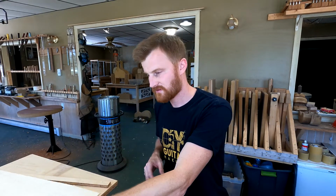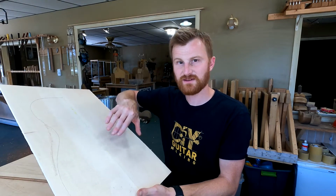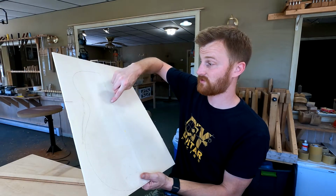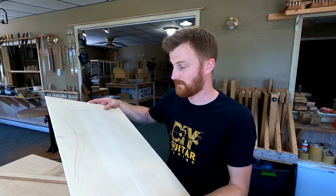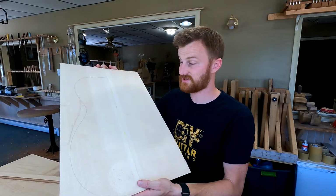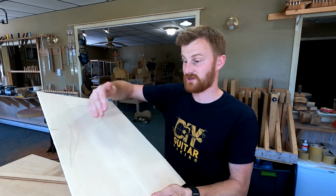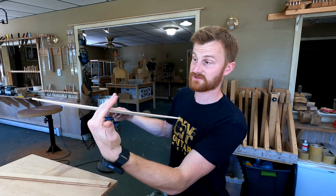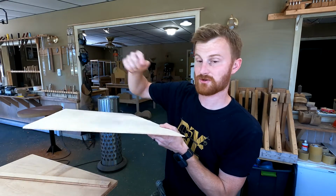But for the top, well, I mean, you could do it the other way. Say if there was a big knot or just some defect on the inner area where the tight grain lines are. Sure, like this knot right here, if that was in here, I would kind of be forced to flip this thing around and do it that way. But yeah, I think that's really the main criteria on the soundboards, is getting those tight grain lines towards the inside. I don't really think about it in terms of inner and outer edge. I just look at the tightness of the grain lines and how quarter sawn it is, and whether or not I'm drifting off of quarter sawn, which is, again, typically what you see as you go to that outside edge.